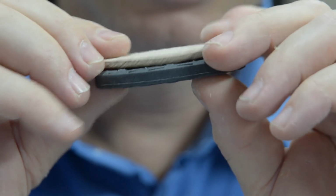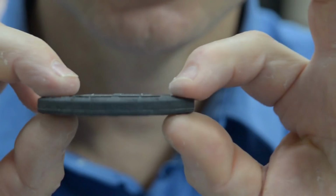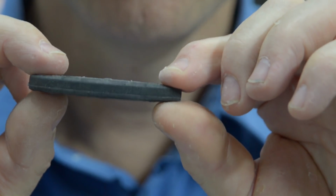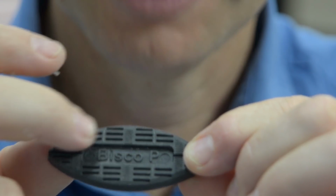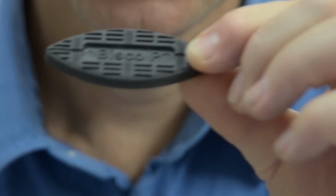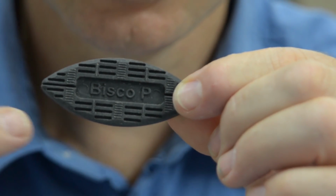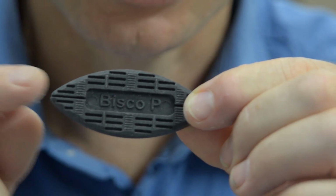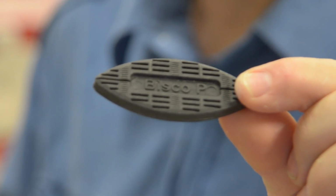The timber one is crooked, they're affected by moisture. This plastic certainly isn't. So you can use it like a flat dowel as a guide to assemble, and it's also got this perforation, I guess you'd call it, to hold on glue if you needed to glue it in as a glue joint. It's also got a marking there, you may see, the centre line, to show you that you've got it evenly pressed into the joint. I won't really be showing that. I tend to use this one just as a guide to assemble for the other fittings at hand.